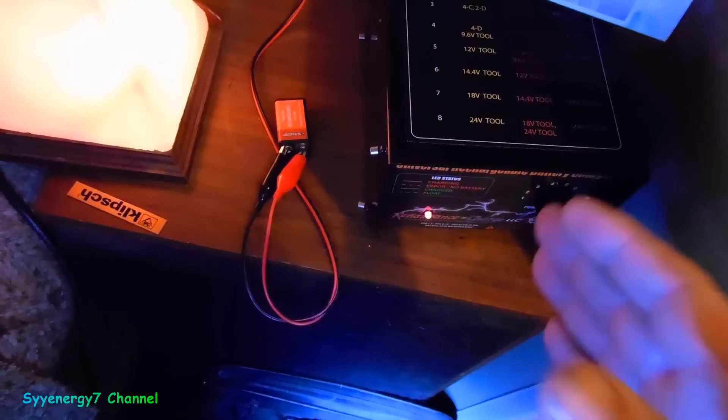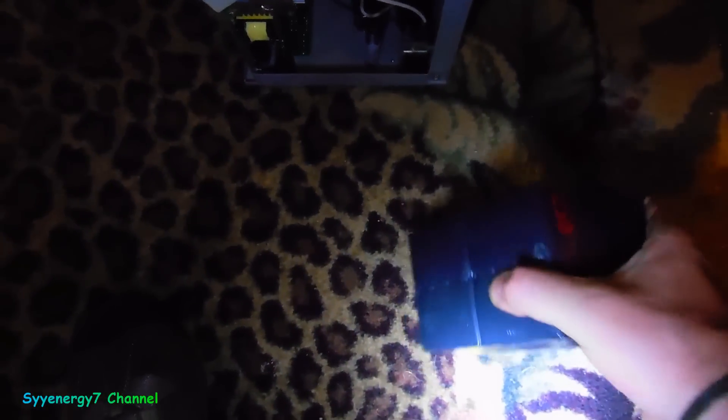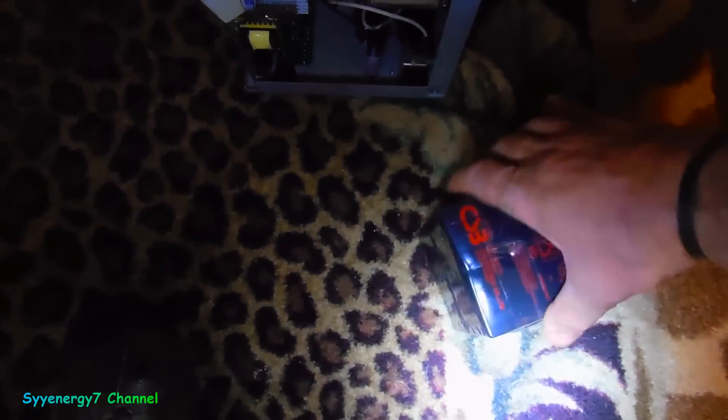But if the battery itself is structurally damaged — this isn't a leaking battery or anything like that, it's a sealed lead acid battery — something happened with it. Could have been a Florida lightning strike. See how badly bowed out that thing is? It's like supposed to be straight, and that is probably sticking out about a good quarter inch on all sides and it's supposed to be flat. This damn thing ruptured. The bottom's flat but not the sides.